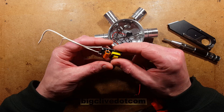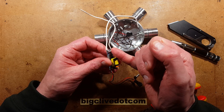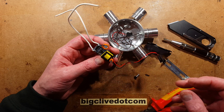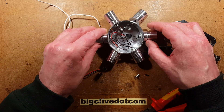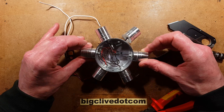It looks like a one-chip-does-all solution, with a discrete bridge rectifier, a little fusible resistor, and some sense resistors. All very standard circuitry. But that does allow for customization, and as I say, you can make this suitable for 12-volt use if you wanted. It's very nice.